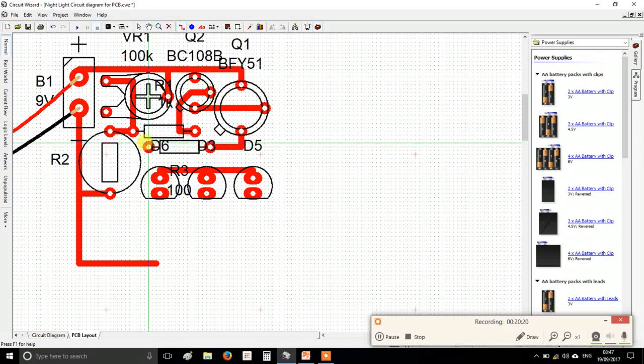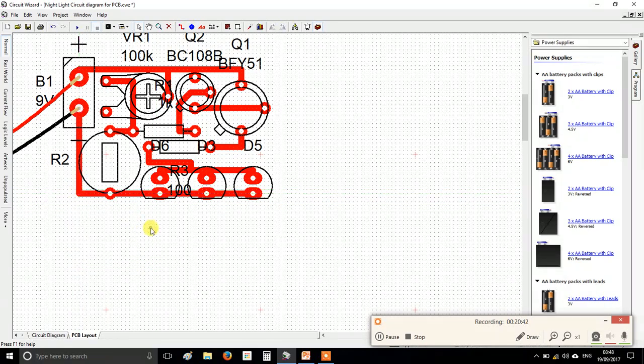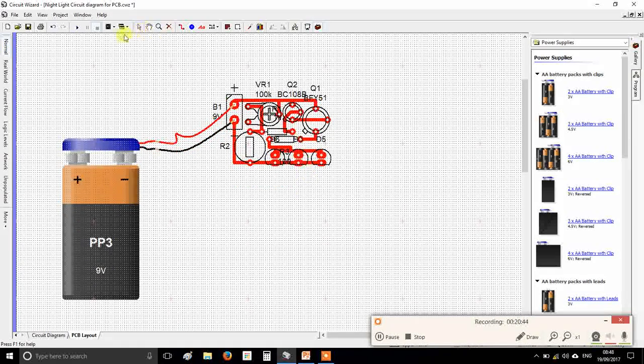And that end of the resistor had to connect to these three guys here. Alright, those three there all had to go to negative. Now I could go down and back here, but actually this point on the LDR is the same place. Alright, going to there is exactly the same as going down and round. It goes directly back to negative. So all of that there is a waste. Bring that up. Okay, and there is my circuit.